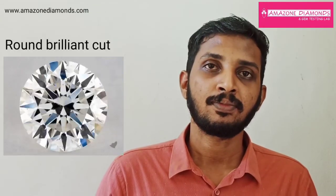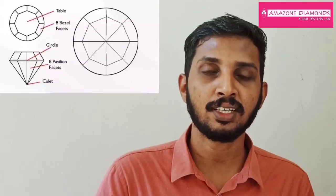These are the steps involved in the diamond cutting and polishing process. The most popular and common cutting style is round brilliant cutting, which has a round basic shape and involves 57 facets. Sometimes, if the culet is counted as a facet, there may be 58 facets. There is also a style in the same round cutting called single cut, which has 17 facets.